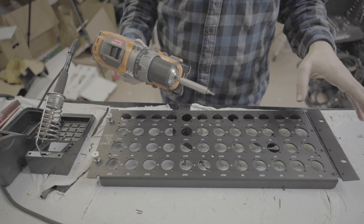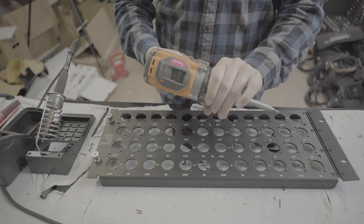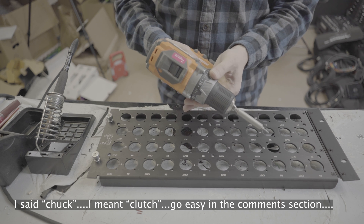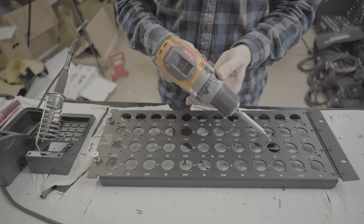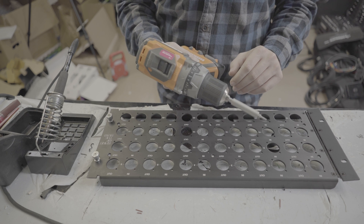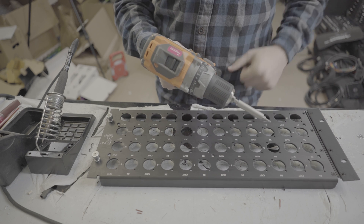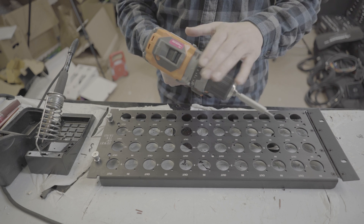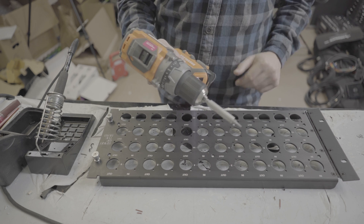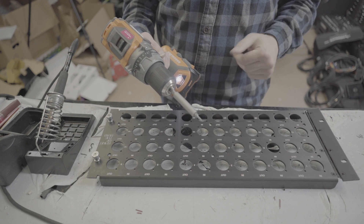If you're building a rack panel this way and you want to use a drill, I highly recommend hand tightening all of these first. We're going to do 48 connectors here so there is a device called a clutch on your drill — use it. You want to be on the absolute minimum torque setting so that you can grab it and it will stop. You don't want the drill bit setting; go as light as you can or you will strip it because it's very small hardware.